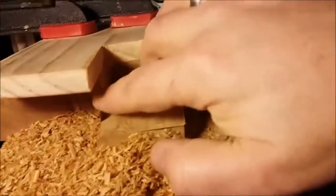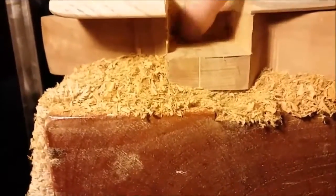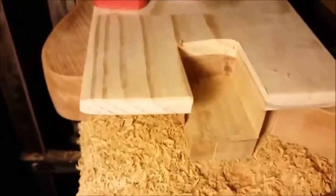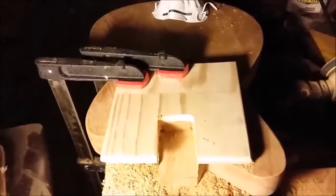Beneath the template you can see some rough bits around the edges which I'll file and clean up in the usual way. I've marked a line just shy of an inch and routed down to not quite that depth, so I know I definitely haven't gone too deep. I will need to go a bit deeper to accommodate the neck when the time comes, and that's completely fine. It's very dark because I still don't have a multiboard in here — when I plug in the router I unplug one of my lamps — but that went pretty well. It wasn't the disaster it could have been. Onwards and upwards.